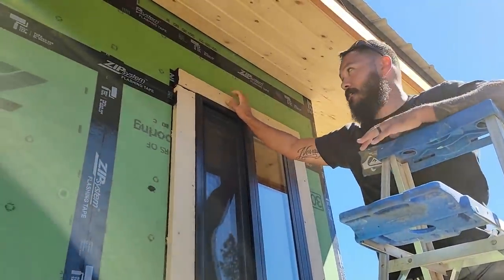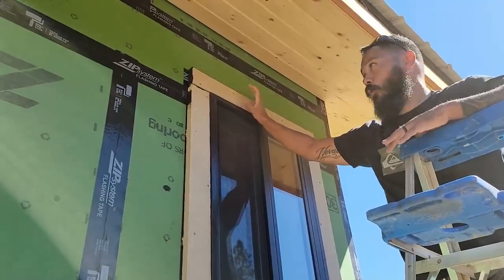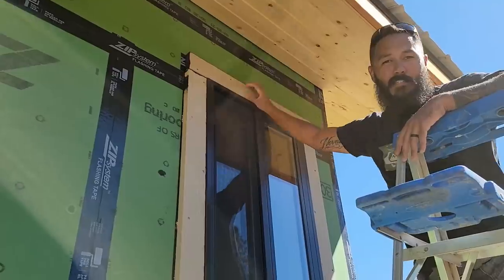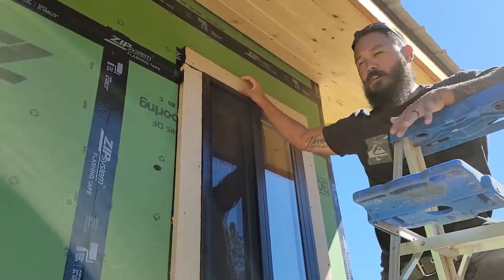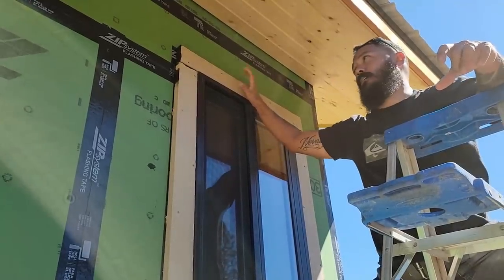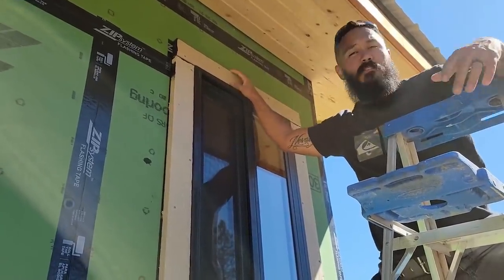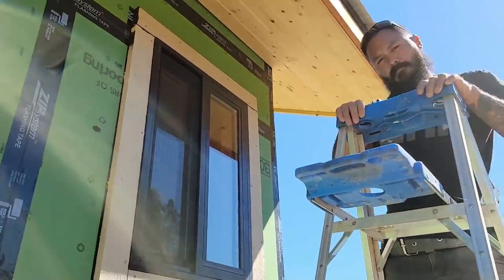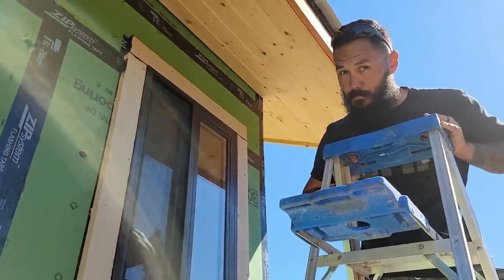I actually cut the exterior strip that's going to go over this one. Basically, we're just going to double these up. It'll stick out past the window, which I know is a little different look, but it's a requirement with the thickness of our siding. So we'll get that second layer put on here, and we'll just continue on the process. Mom will work our way all the way around the house. Sounds good. I will paint the ends for you. Thank you. You're welcome.